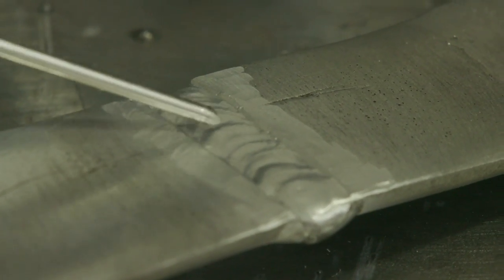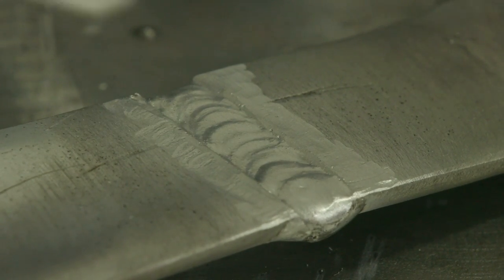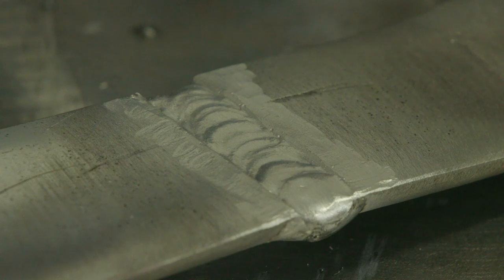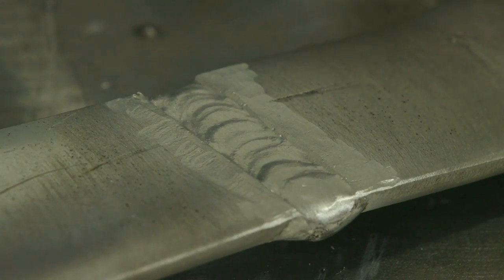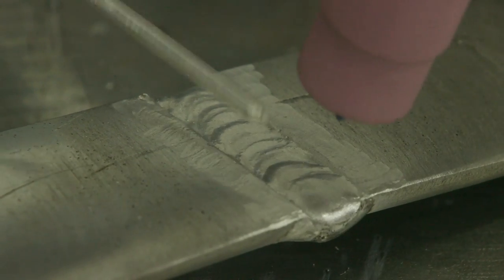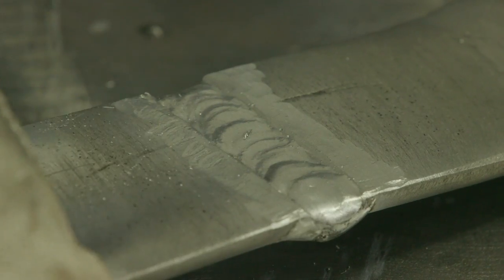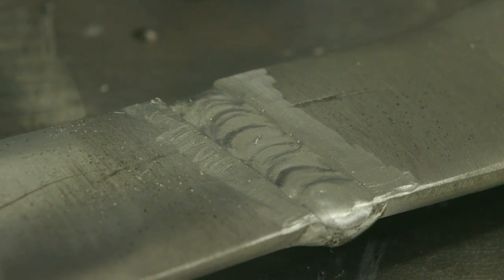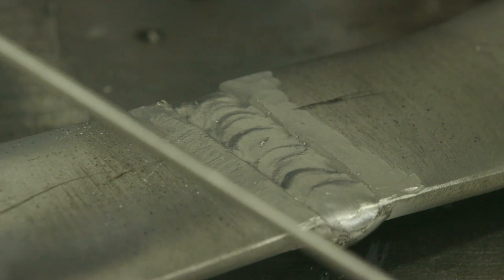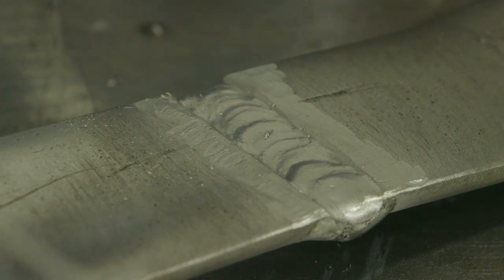When I V'd this out, I got in there kind of deep. When I was coming across it, I started here going this direction, and I've since turned this thing around. When I got to the middle, I hammered on it a little bit to make this aluminum sink. When I got out here to the edge, I could decrease my amperage — I'm still wetting in nicely. I went and brushed it, and now I've turned it around and I'm going to try to do this final pass. It's kind of a sharp edge — it's got a radius on the top side and this is flat and sharp. I think I can see why this thing broke, because it's pretty flexible in here and it's bending back and forth pretty good. This should be the last weld that we put on there, and then we'll see if the customer wants to sand it flat and try to blend it all in.